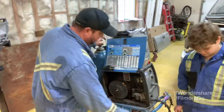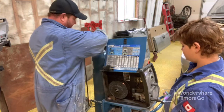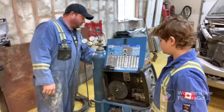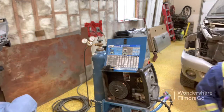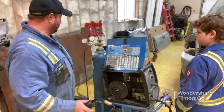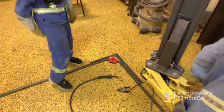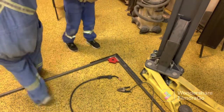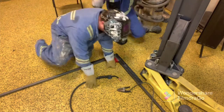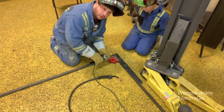So there we go. That's going to be where we're going to start. We'll turn our gas on. And for me, I run it at about 26 pounds. So we're on. So there we are with it running. It drops down to about 25 pounds. Welder's on. Full helmet is on. Yep. Gas is on. We're gonna take our ground. We're gonna make sure we put that on.